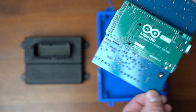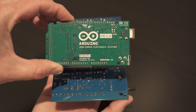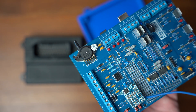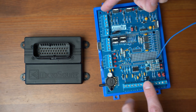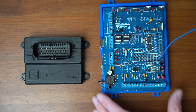Another key component is that if we flip it over, the Arduino Mega 2560 sits on the back and is actually removable. There are headers all along here that you can take it off and put it back on. You can switch out the actual computer. This board here is just an adapter — a daughter board — for the main Arduino board. It takes all the inputs from the engine and outputs and converts them into a signal or voltage that can be run off the Arduino that sits underneath.